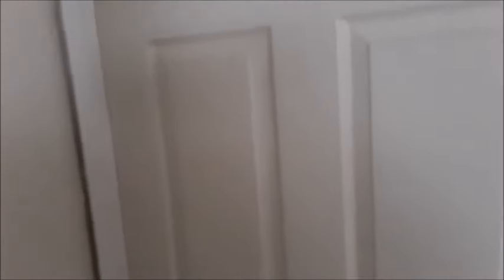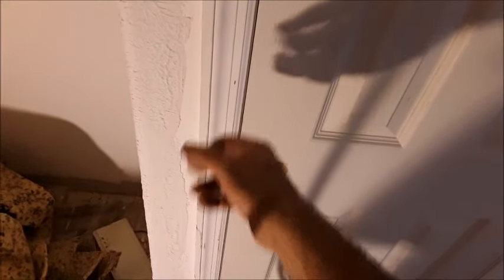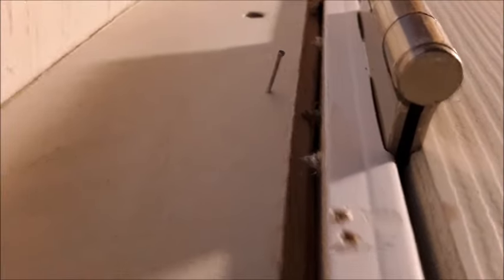When going to hang your door, separate the two pieces of the pre-hung door — you can see how the groove on one piece fits inside the part attached to the hinged side of the door. We want to attach the side with the hinges permanently first. That way, on the side where the door swings, we can move it in and out or put spacers in as needed to make sure the clearance when the door swings shut is proper. Be sure not to put a nail through the area where the other side will join. Put the nails on the outer edge with it pushed up as far as it'll go. One thing to watch out for is the screws coming out of the pre-hung door casement for the hinge — they stick out a little bit and may prevent the casement from going fully flush with the wall.